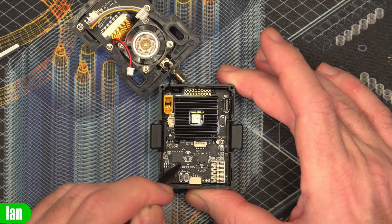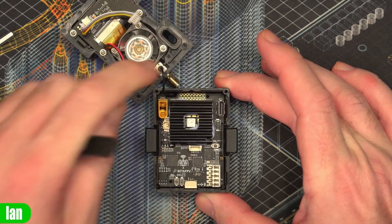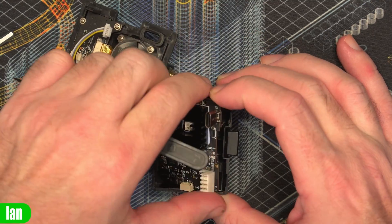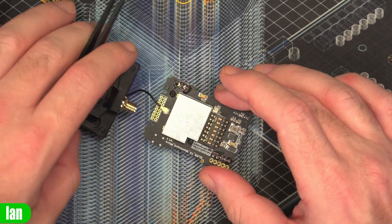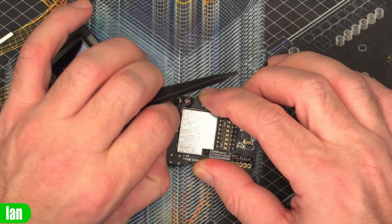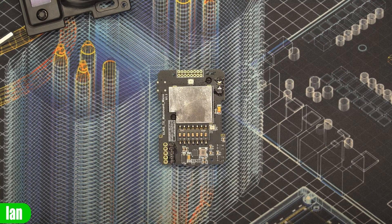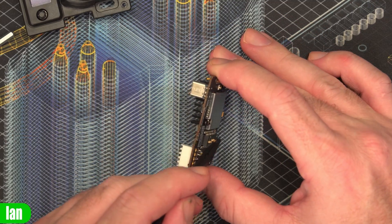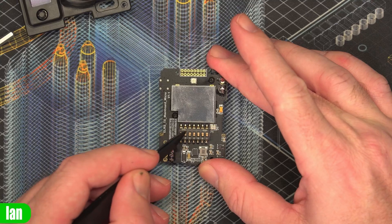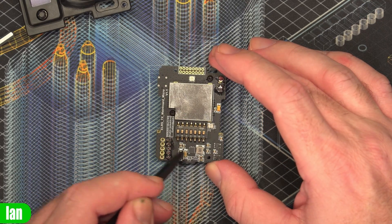There are also a couple of buttons labelled on the PCB. Popping out the PCB is done by removing the screws and then gently lifting the board until it releases from the plastic casing. Flipping it over, you'll see the antenna cable coming through a cutout in the PCB — it's a UFL connector, so you can gently release it. On the back of the board we have the Express LRS module itself located under a shielding can, cooled through the main PCB via the heatsink. We also have the switch pack for selecting firmware update modes and additional circuitry that looks like a BEC for powering the system.